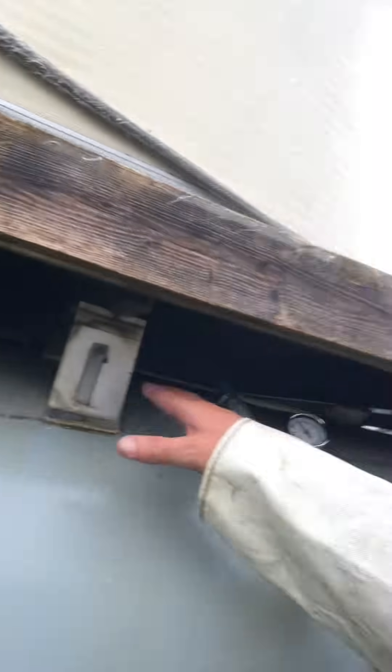The plan is to mark those areas so that we can drop the pontoon and take it to our welder and have him do a more permanent repair — some doublers, fish plates as they call them, whatever he thinks is the best thing to do. These pontoons are a pain in the butt to weld on just because of the location. Gavin's found two more, so we're planning on just dropping the whole daggone pontoon and taking it to the guy to have him check it out.